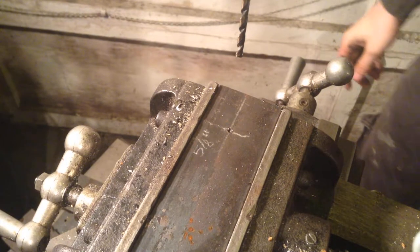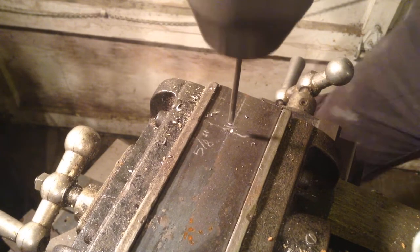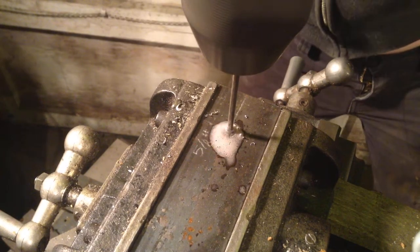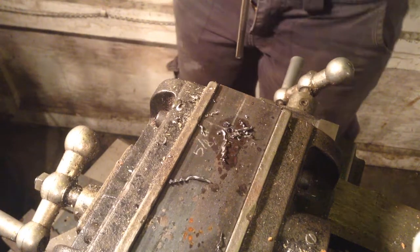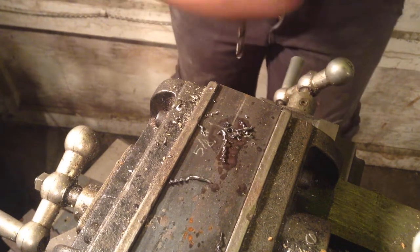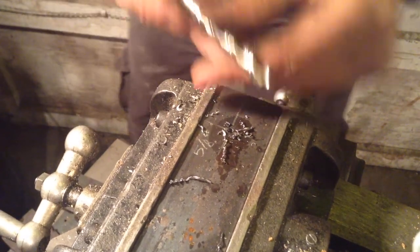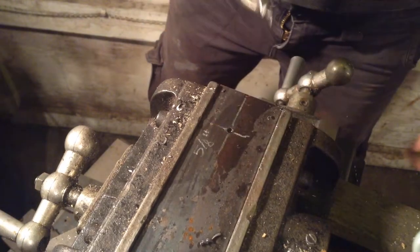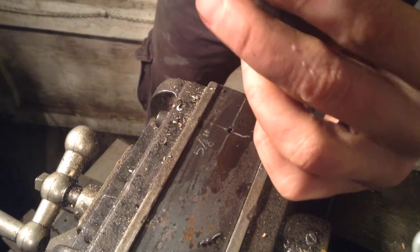We're ready to drill the hole. We're going to touch down with our 1/8 inch pilot — a little lubricant. Then we've got a pre-pilot step drill tip, like so, and that's got a nice little radius at the center. This is 3/8 inch to match the 3/8 inch carriage bolt.